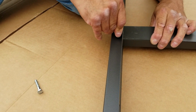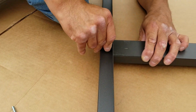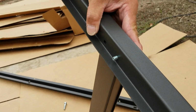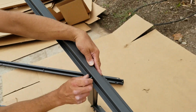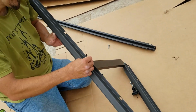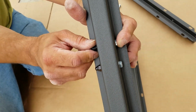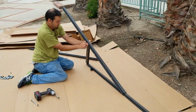And then you just put a cap nut on the end of that, and after that's inserted, then the other hole is going to be lined up better, because this one will be through. So the second one should always be a little bit easier, because everything's lined up on the first one. There you go, put the little cap on there, and it's pretty much half assembled almost at this point. Then you run that last bolt through, and as you see, way easier and quicker, because everything's already pre-lined up with the first one. So then that's attached, and again, just hand tightened for now.